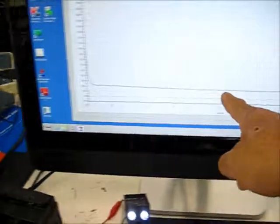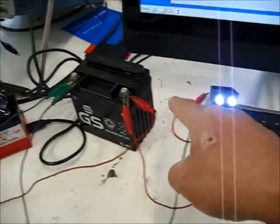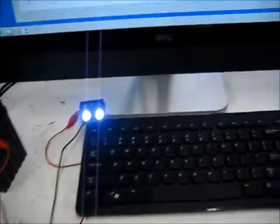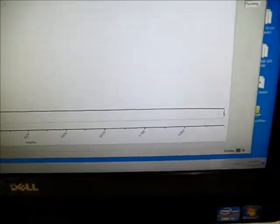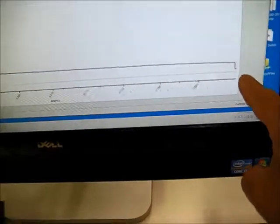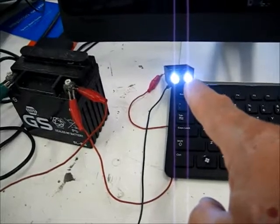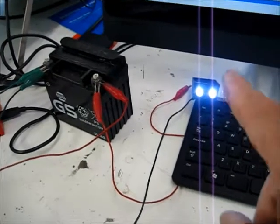It took a while for this West Mountain Charger to respond to this oscillator with this battery that supposedly is dead, which it is not. But you can see what it's doing — the crystal will seek the level, and it's over 1 volt, about 1.36 volts. I suspect that this can continue on for quite a while, because the oscillator can run below the trigger voltage of the transistor. I just wanted to point that out and make sure you have all the facts so you know what you're dealing with.